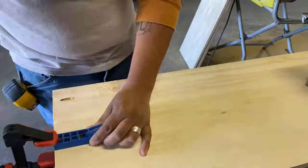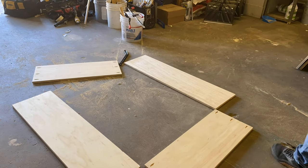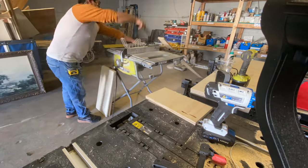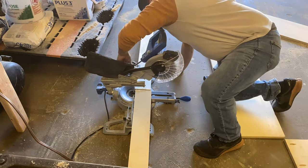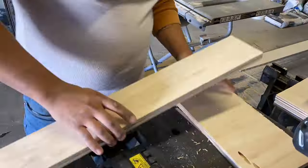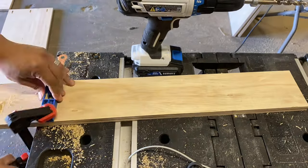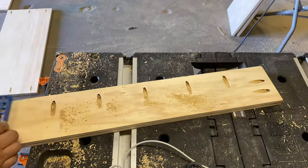Not sure yet what I'm going to do with that review, but if you're interested let me know in the comments. Next we have our panels laid out in the shape they're going to go, and here we're cutting a one-by-four brace — a small piece that goes on the back of the cabinet to help keep it square. I'm cutting two right now, one for the bottom piece and one for the bottom shelf piece, then I made pocket holes for it — three on each side and one on the top every four inches, on both pieces.